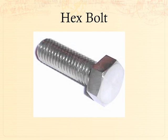A regular hex bolt is what you're pretty much going to buy when you go to the store. It has a hex-shaped head, and there's a whole series of combination wrenches designed to fit over the head. Bolts are measured by the diameter of the threaded portion and come in very specific sizes — English sizes like quarter inch, half inch, five-sixteenths of an inch, and so on. There are also metric sizes. In the United States, the stuff you buy at the hardware store is going to be English in inches, though a lot of automotive and build-it-yourself-at-home furniture comes with metric bolts.